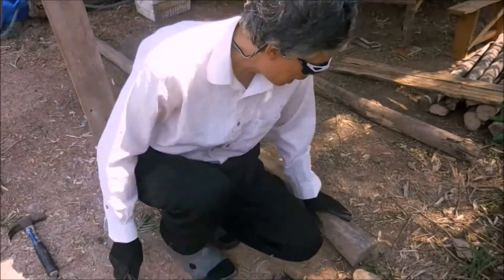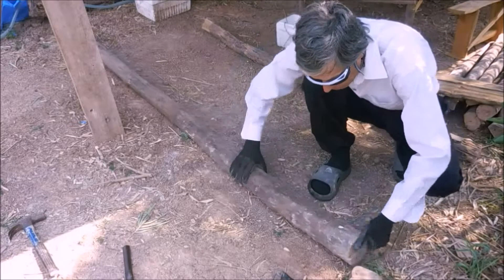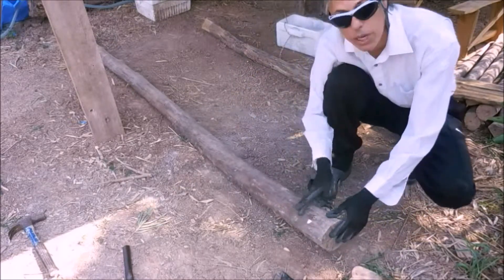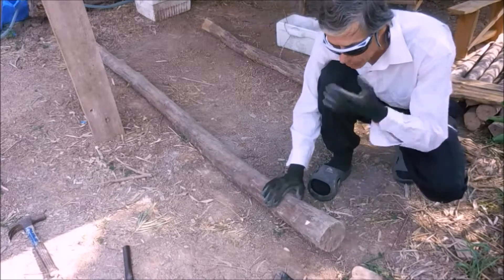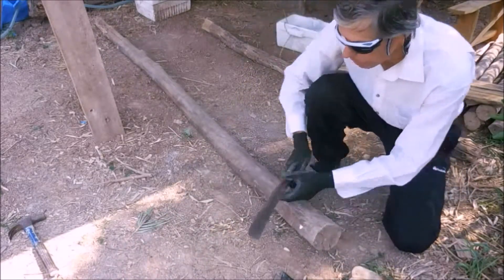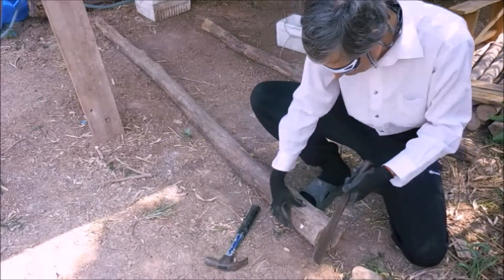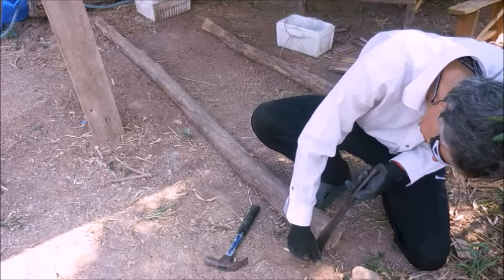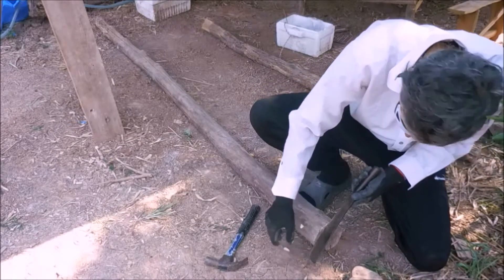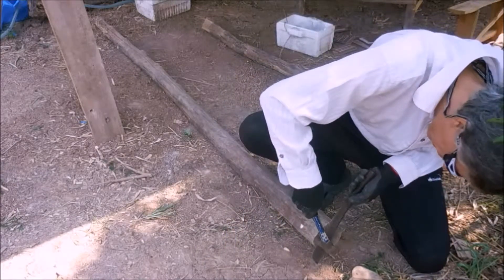Just like that. Now you need to make your normal flat joint here. I've started the process, turned that around, and made my cut. The cut can be deeper than required — it's about a centimeter deep, it doesn't matter if you're a bit deep. Let's make our flat joint just like this. Make sure it's nice and straight. It's about a centimeter or so, nice and straight.